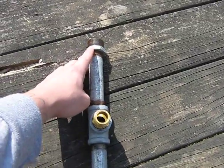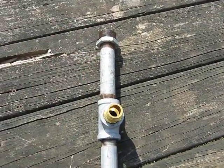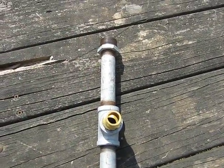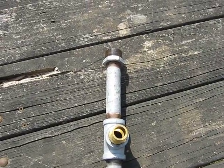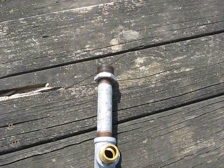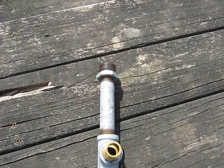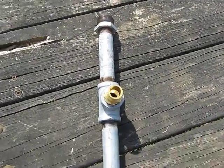Up here I had an old pressure bladder hooked in just to keep pressure on it. There are people that put little pressure vessels — it's just a hollow tank with nothing in it other than air. But you have to have a burp valve, or it'll eventually just fill up with water. The oxygen will just dissolve into the water, and then you have no pressure against it.